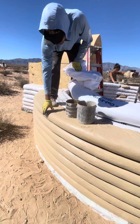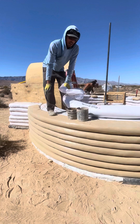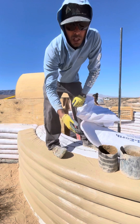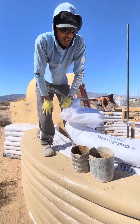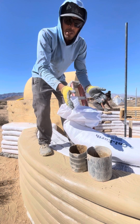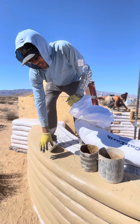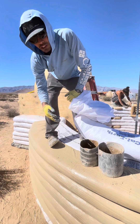So that's what this bag is right here — this is technically just another circle that's adjacent to your main dome that you're making, which is this white bag here. This is going to go a foot above spring line, which is the technical term for where your dome actually starts to curve and doesn't become a cylinder anymore. This looks really tall because we have an 18 inch spring line, meaning that this buttress bag here is at 30 inches, a foot above our spring line.